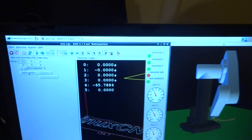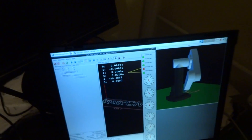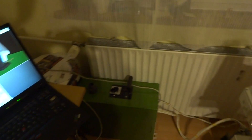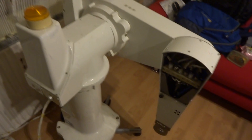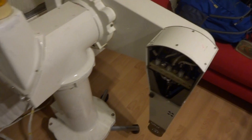As you can see here on the right side, the home switches — the three bigger joints are directly connected to the home switches of Linux CNC, and the smaller joints, joint four to six, are shared with one home switch.